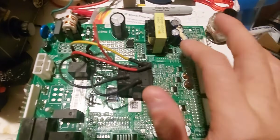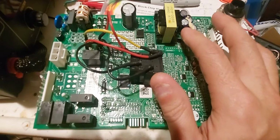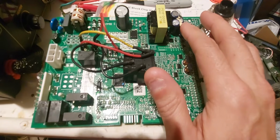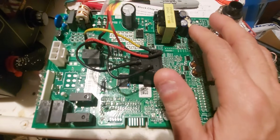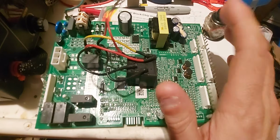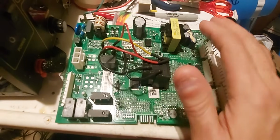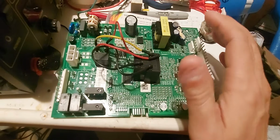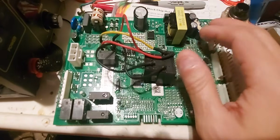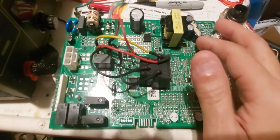They're probably okay capacitors. Now, some capacitors have certain hours on them. For example, these could be 2000 hour capacitors, but they do sell 5,000 hour capacitors and maybe more. I usually buy the 5,000 because if I go over that, then I'm spending a lot of money, and sometimes it's just not worth it. Maybe you're selling a kit, or I guess if you're installing them for someone, yes, it's worth it, and of course for yourself. But in certain cases they're not worth spending $8 a capacitor, right?